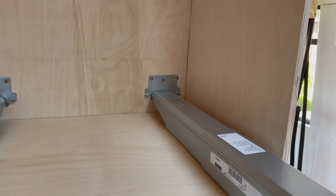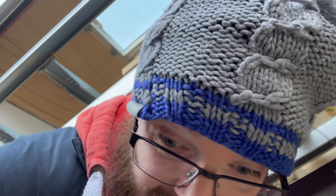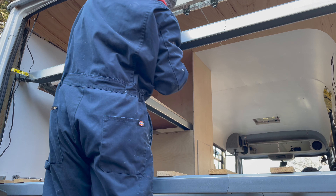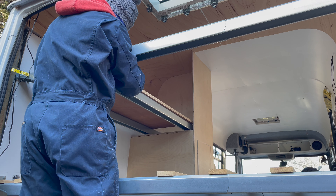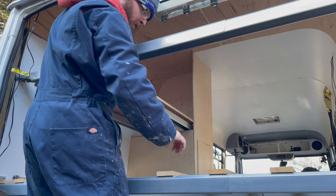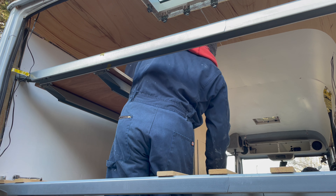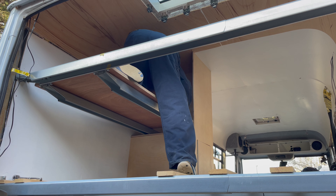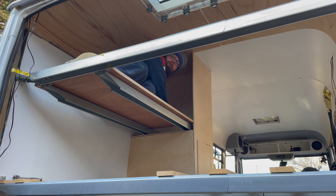Just taking the time to finish up wiring my fuse box as well. My label maker's still not been returned, but I've put on some temporary labels for the time being, and that way I can screw the top on. I'm going to pop some P clips on to make sure everything's neat. I put two fuse boxes in here, which seemed overkill. I've got ten spare slots left over, but I know I've got three or four more things I definitely want to run into the kitchen and such. Two fuse boxes is more than enough — maybe too much — but we're future-proofed.